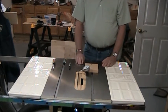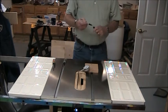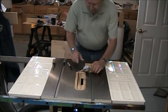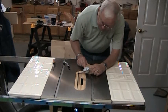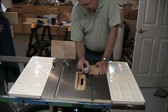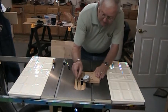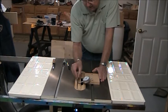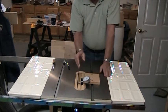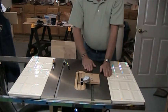Put your guide bar and your jig in the miter slot. You mark a tooth on your saw blade, put your dial indicator on just off that tooth, and set the dial indicator to zero. Rotate that tooth around to the other side and read that same spot with your dial indicator. It tells you how your blade is in relationship — how parallel it is to your miter slot.